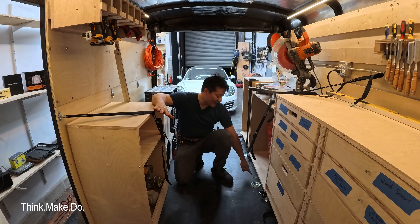I replaced all the sides and foam insulated — about an inch of foam on each side. The bottom sections up to about 40 inches is half-inch plywood, because I just need a solid surface to put things against. The top section, the last 30 inches, is three-quarter plywood drilled directly into the steel rails going up the sides, giving me a really strong mounting point. I've added French cleats so I can bring in tools from my workshop's French cleat system. I screw them down so it's secure, but the cleats let me decide where things go and slide them around as needed.